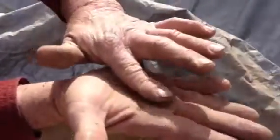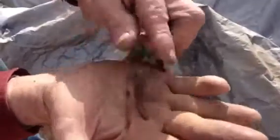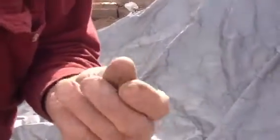The only thing that makes it stretch is clay, and that's what we need. By being able to roll this and make this little clay ribbon, we can see that it has enough clay in it to make a block. Now, whether or not the block would be perfect, whether or not it has enough clay to make a great block, we don't know that. What we do know is that we can make a block, and that with whatever block we have from this, we could build a house.